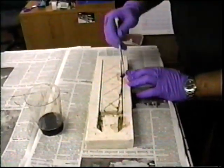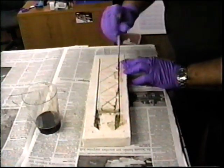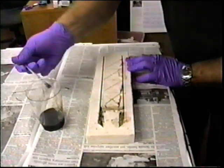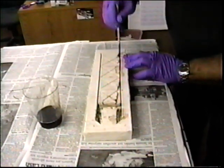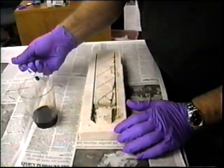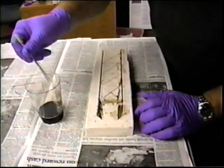You can put extra resin in there, because as you pack the tow, it's going to come to the surface. You just get the mold wet. And a couple of air bubbles here and there, cosmetic air bubbles, not a problem at all. You still want to try to keep the minimum amount of that stuff. We want to pack as much carbon in here as we can.